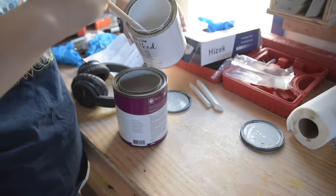Now moving on to the wall trim, that had dried nicely and I am gonna take this Gorilla Glue mounting tape. Normally I just use a Scotch mount tape, but this Gorilla Glue one was clear, which I thought was interesting to maybe even make it a more seamless and invisible transition. But honestly, it was so hard to peel the backing off of these little pieces of tape that I switched back to my tried and true, but I will link both down below if the clear option is one that you like. But now we are putting in all of the shoe molding, attaching that to the baseboards, and then using the Scotch mounting tape, we're gonna put on all of the wall trim.